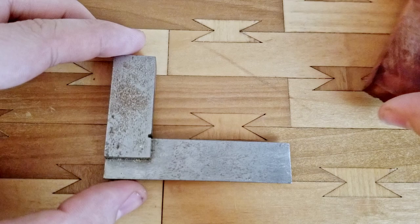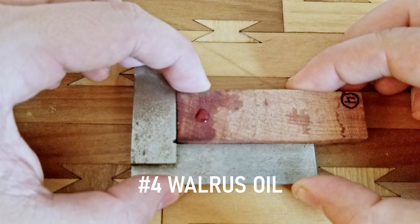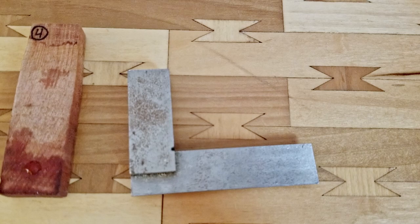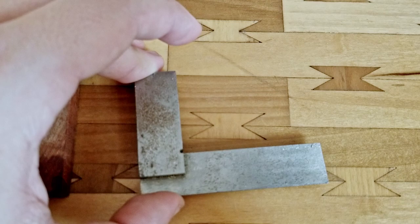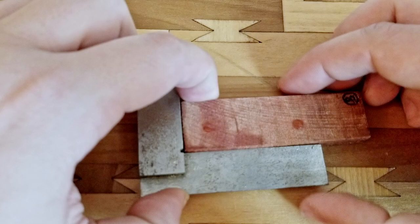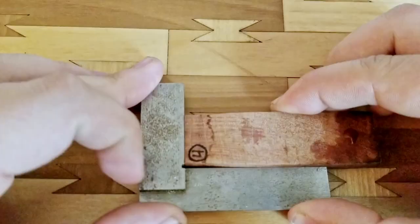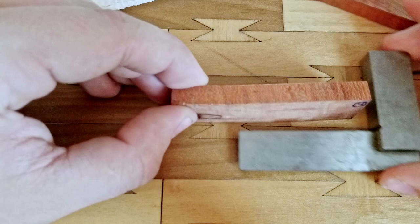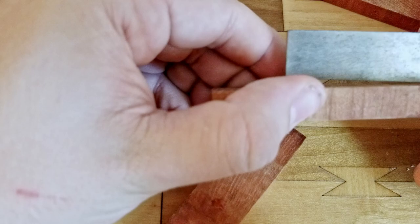Next I'm just going to do a quick squareness check. These are end-grain heavy samples of different thicknesses and some have small knots, so results can vary — I'm not putting a lot of weight into this. Pretty much every sample had some kind of warping, even the tung oil samples had deformed. The only one that really stayed straight was the shellac, number five — though it may just have been a slightly thicker sample. Over the course of these tests I'm seeing that the tung oil and d-limonene mix is performing slightly worse than pure tung oil. I think the d-limonene is thinning out the seal and letting more bad stuff in. I still see value in adding d-limonene for the first coat to help penetration, but for the final finish I'll coat with 100% tung oil to make the seal even better.